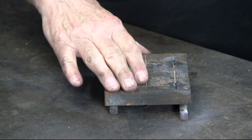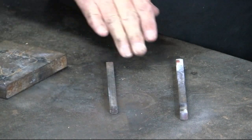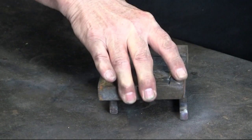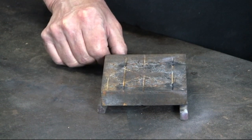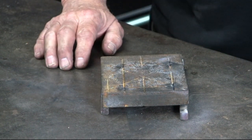This is a very basic heat sink. It's a one-half inch block of steel supported by these two three-eighths inch pieces of square steel, so air can flow beneath the half-inch block of steel. Thus, the heat from the torch is never directly on the welding table.